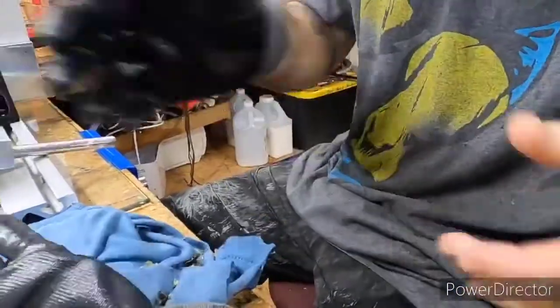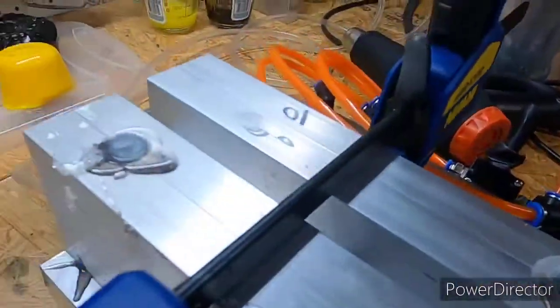I've had custom orders where the customer made an order for an extremely hard color to do. Certain colors don't laminate real good. Some of them laminate perfect, like these right here usually laminate great. It all depends on the style of baits. I got a swim bait that laminates okay. Darker colors, pretty good, because you can't tell as much. But the way the mold is designed, it laminates horrible, especially with bright colors, because the brighter the color or more translucent, you can see the inconsistencies in it.